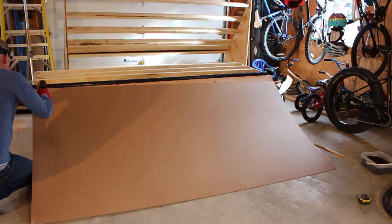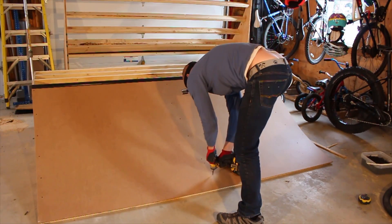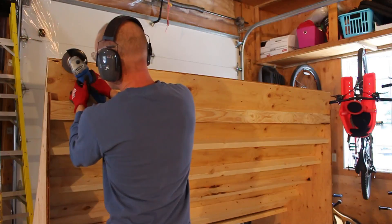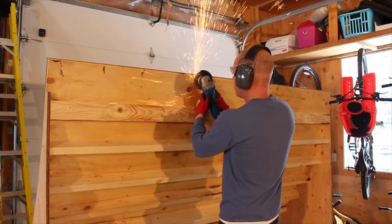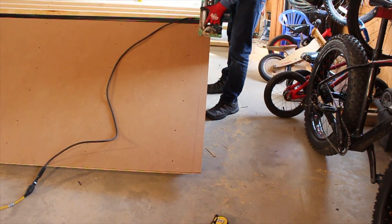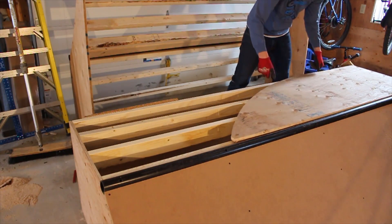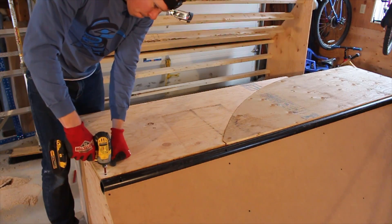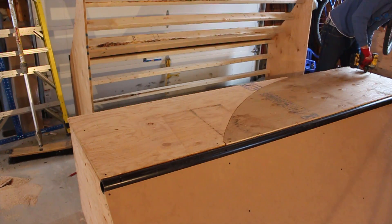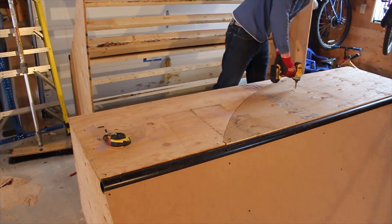For the top sheet I used a quarter inch thick sheet of hardboard. When you screw this sheet down you want to miss the 2x4s to prevent the possibility of hitting a screw below, which will really mess up your hardboard. I also screwed about every foot along the bottom of the ramp — these screws stuck out the bottom, so I took the sharp points off with a grinder to prevent injury while moving the ramps around. Because one of the ramps is one and three quarter inches narrower than the other, I had to trim the excess by drawing a line and cutting it away with a circular saw. For the flat sections use the off-cuts of the 5/8 inch plywood. Remember I said pay attention to the orientation on the plans — I didn't, and it created way more work because I had to cut pieces to fit. Simply screw the plywood down to the 2x4s about every foot, and the chalk line trick comes in handy here as well.